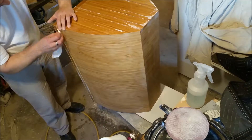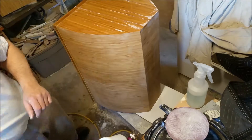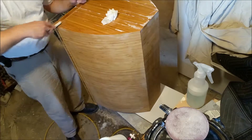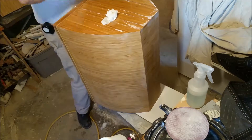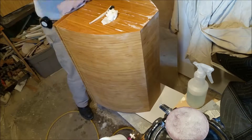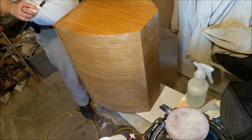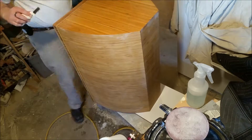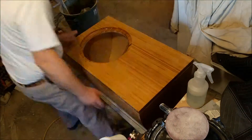All you're trying to do is rough it up enough so that the next layer of varnish sticks. Now we go to the top - clean the edges again. The old toothbrush works pretty good, but it's not really a toothbrush, it's a brush specifically for cleaning spray guns. If you put a normal toothbrush into lacquer thinner or acetone, it just melts.